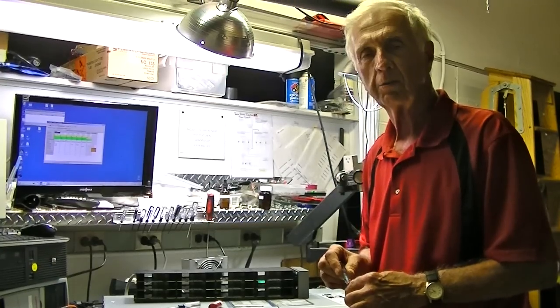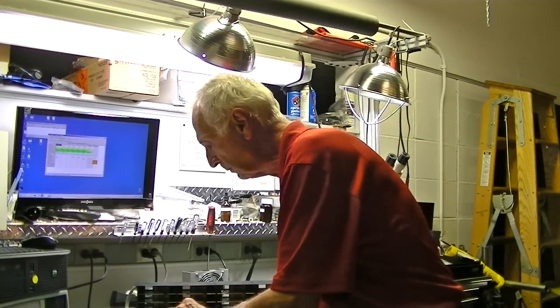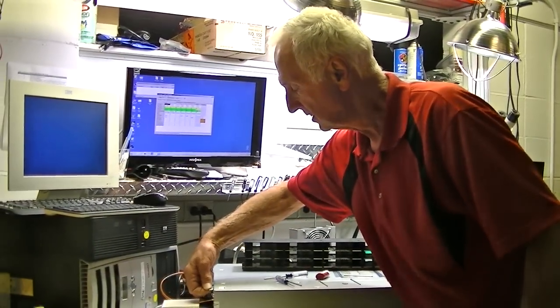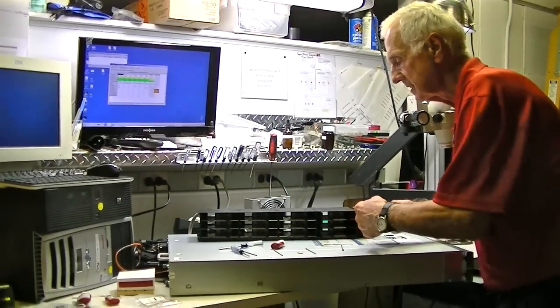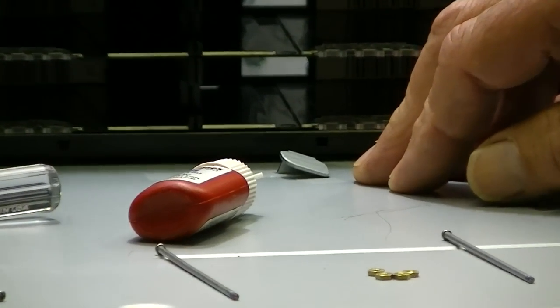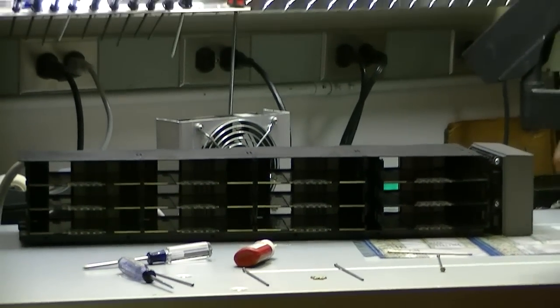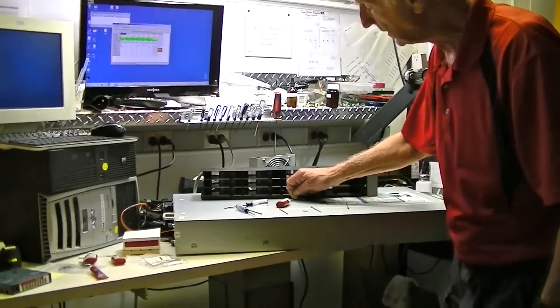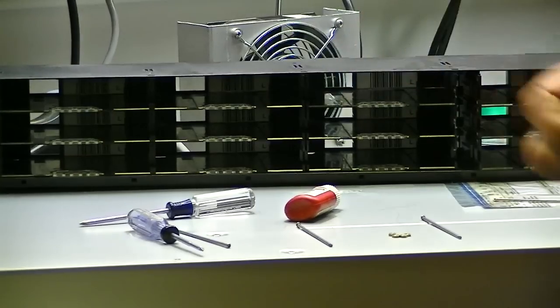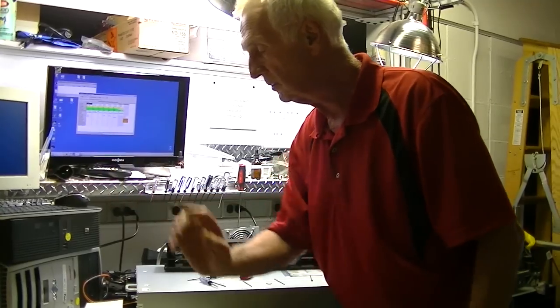That's about all I have. Thank you for your time and thanks for watching. One more thing — this little key here is a lockdown key. It fits in this slot, and if you're going to move your library or ship it anywhere, you need to install this key. You power the library down via the front button — don't pull the power cord out because the picker won't go back to home. The picker will go back to home on its own. You put this in the slot for shipping, and you have to remove it before you turn it on. There's a little slot back over here — stick it in there, put a piece of tape over it, and you're good to go.